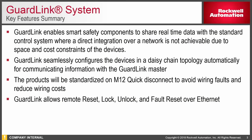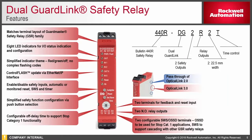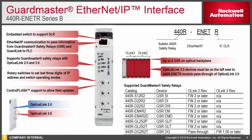GuardLink includes taps. Those standard taps allow you to use four-, five-, and eight-pin cords. You have the ability within each device to lock, unlock, or reset if you have a fault on that specific device. The GuardLink safety relay allows you to drop 32 devices on each GuardLink chain, and there are two GuardLink chains for each relay. You must pay special attention to how much power is used on each chain. You can also cascade to additional safety relay products if needed. GuardLink has an optical backplane that connects to a standard PLC through an Ethernet IP interface, allowing up to six GuardLink relays in series, giving you multiple output devices based on your system needs.